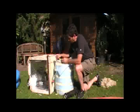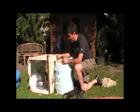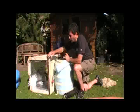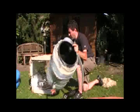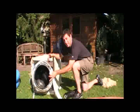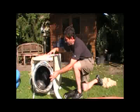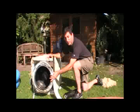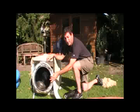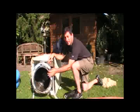So it's 126 centimeters around, and we're going to make strips to go around it. This is a bit like calculus — but we're using straight segments and approximating a curve, so we don't want to go too big because that leaves a lot of airspace. One of the problems with the box approach was the amount of airspace around the barrel inside. It's not just that heat was lost — in Cairo, rats tended to get in. At Hanafati's place in Cairo, before we used strips tightly around the tank, he had his tank insulated with a box like this. Rats loved the warmth and burrowed in, made their nests inside, and eventually ate up a lot of the styrofoam and rubber and polypropylene pipes, causing leaks. So you don't want open areas where rats and vermin can nest.